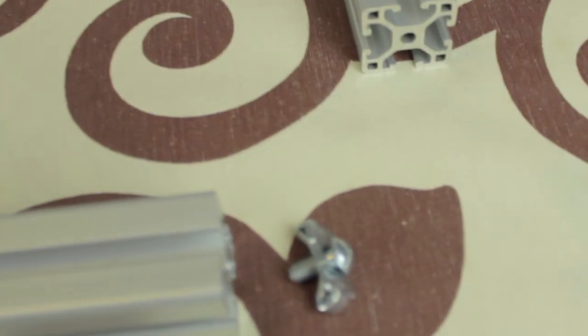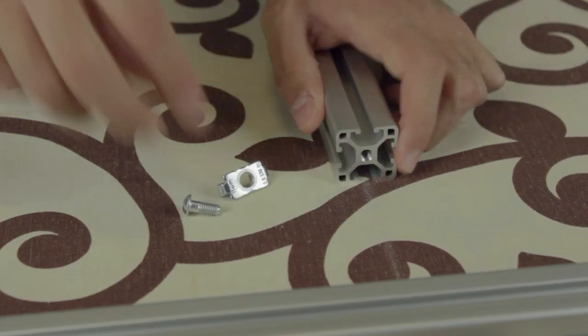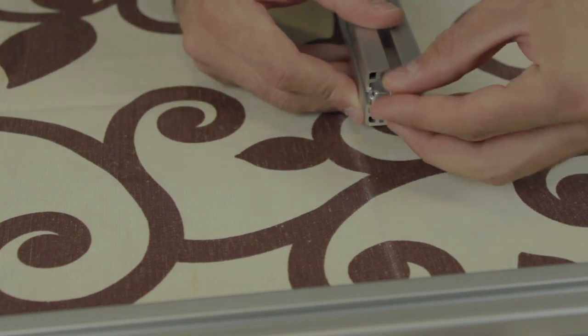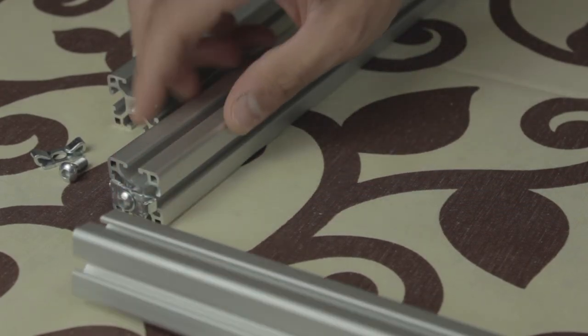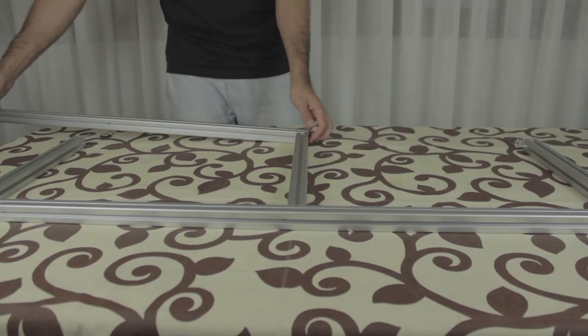I have prepared all the necessary standard unions — six in total — to build the structure of the print bed of the Architects 3DP Mega. I'm going to insert all of them in place, starting with the middle bar. Remember, don't tighten the screws yet. We're going to insert the fastener through the slot and slide it to the correct position.